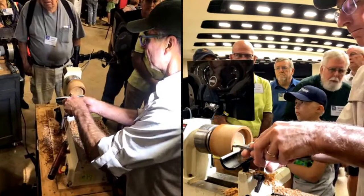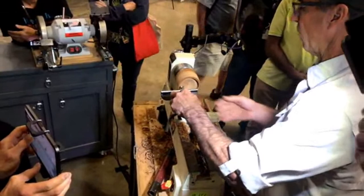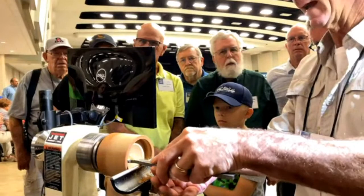So I've got one or two lines in there, and they're in a spiral, because I can feel it tugging the chaser up into the piece. Now, I won't cut, but I'll show you what happens when you travel. The threads that I've already made, if I take the chaser and start moving it towards me, will start digging further deep into that wall. And notice my chaser is horizontal.